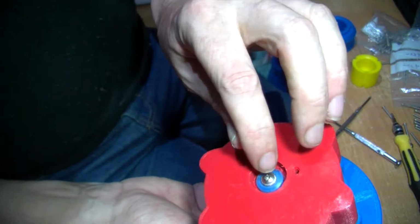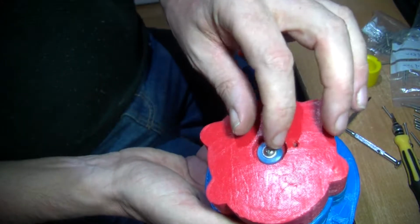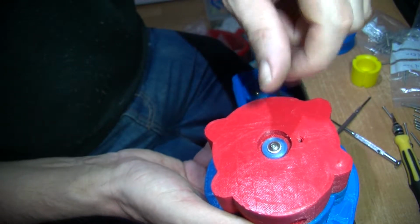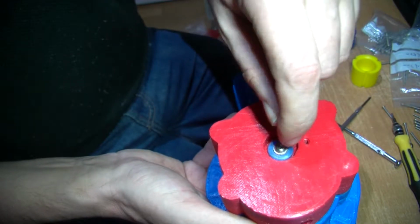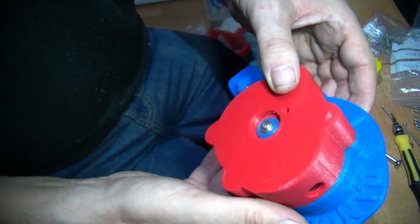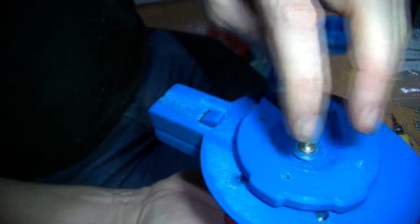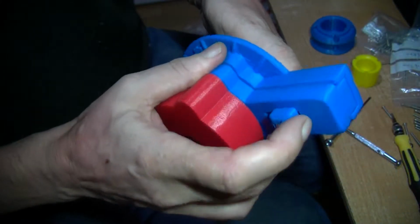Anyway, these holes are drilled to 3.5, or 3.2 if you have one. Then I force the bolt in, take the bolt out, which cuts the threads in the PLA, and then I actually put the bolt in to be used. I do the same in all my things. These are 3mm, all button head, and these are flanged.